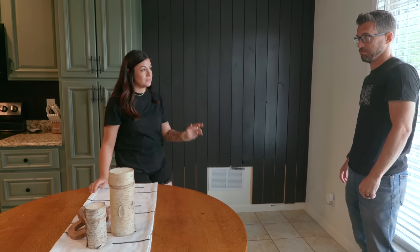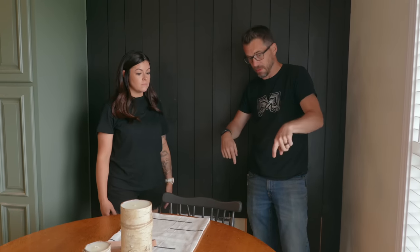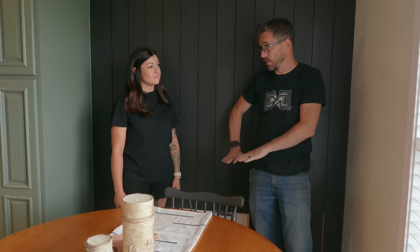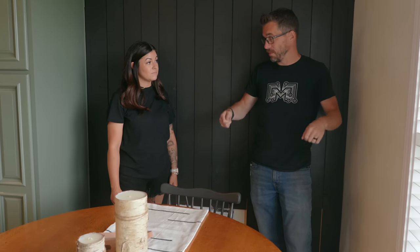So it's got to be a narrow bench that fits back in and allows more people around the shape of the table. The table is also a little lower than normal since it's an antique, so we have to build seating lower than normal to match. Rather than just making a bench you could lift out, we're going to build it in so that we can hide stuff inside of it.